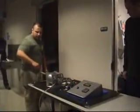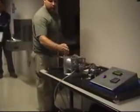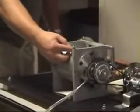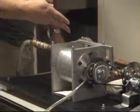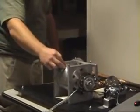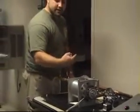So right now we have the water that's running through the turbine. The bypass valve has been closed, so all water is running through here. We have 16th-inch holes that are drilled out here, so as the water flows through, it then shoots in between discs that we have evenly spaced at 1/8 of an inch. The 16th inch spray of water grabs the discs, uses friction to rotate the shaft.